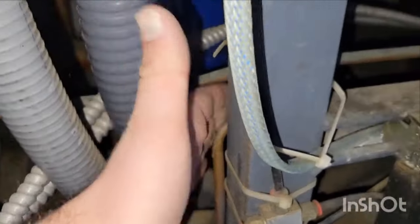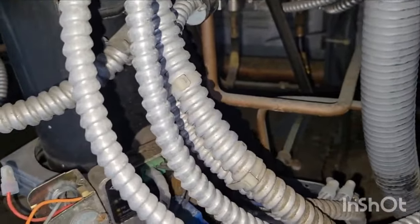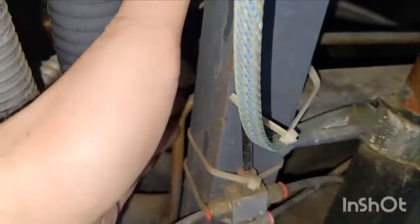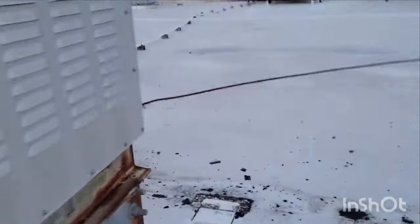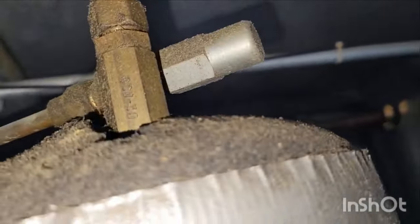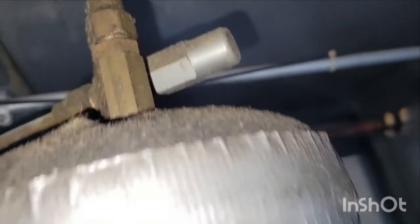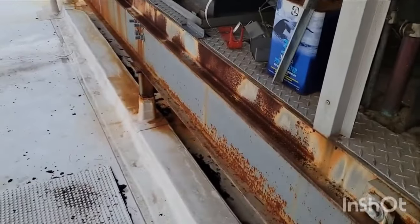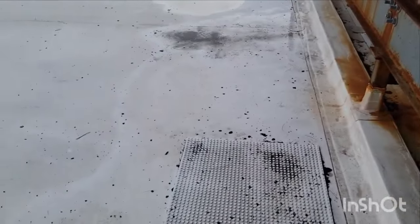So this is cool right now, but my theory is it's because this compressor is filled with oil, and there's not enough oil to actually feed. But you would follow that feed to your oil reservoir. And in this rack, oh, there is a check valve on this oil reservoir. You can check if that check valve works right there. Now, I have a video on how to check that and how to change the check valve. I'll post that video below, and I'll explain it a bit in the pen and paper as well.